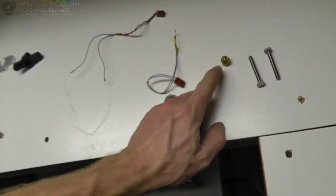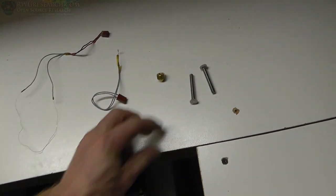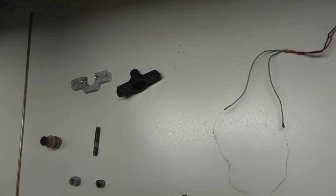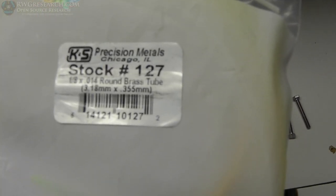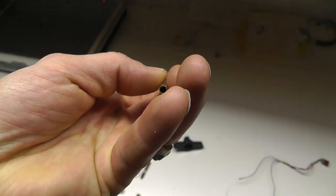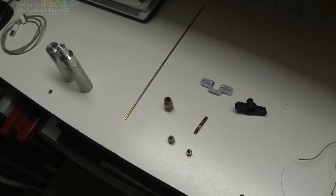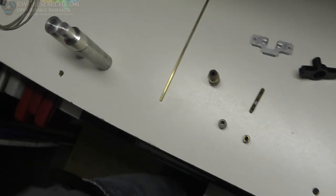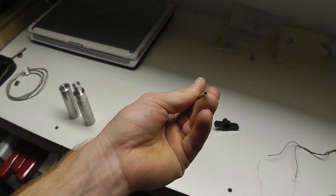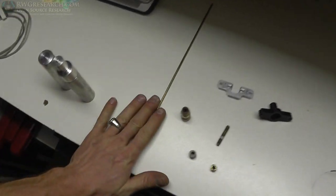The real problem too is this is a 0.25 thread and this is M6 metric, M6-1. So I got some stainless bolts, and then I found this tube at the local store. This tube has a hole in it with about the right size diameter - it's about 2.4 millimeters. I'd rather be a little oversized instead of undersized in case stuff gets stuck. My original thought is that this will be the insert, because if I can put this in there it'll be perfectly smooth since it's extruded and seamless. That's my idea for using this brass insert.